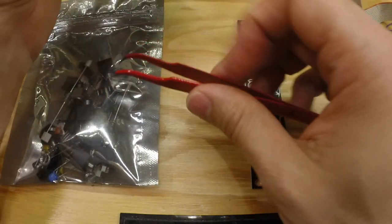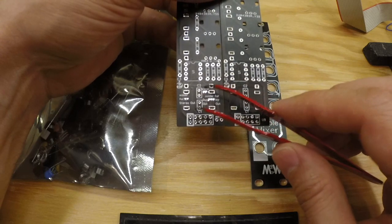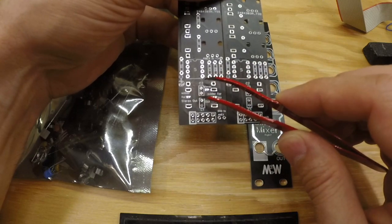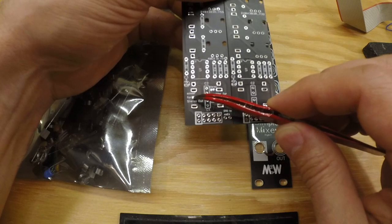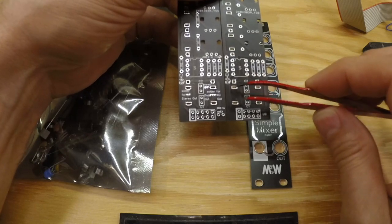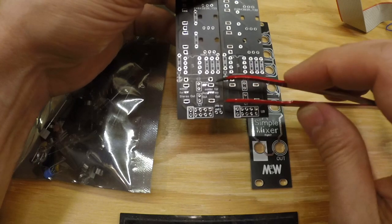to keep costs down, the jacks I'm using are actually stereo jacks, and I figured that the output, because very often you want to put this one directly into a mixer or an audio interface or whatever outside gear, and then especially if you put it into a DAW or a computer, you want to have stereo out. So there's a solder point here that you can just solder together and you will get stereo out. So you get the mono channels on both channels. That's good. This is not on the old board, but you can just solder these 2 points together. That is what this little thing there does. So just put a small lead between these two and you will have stereo out.